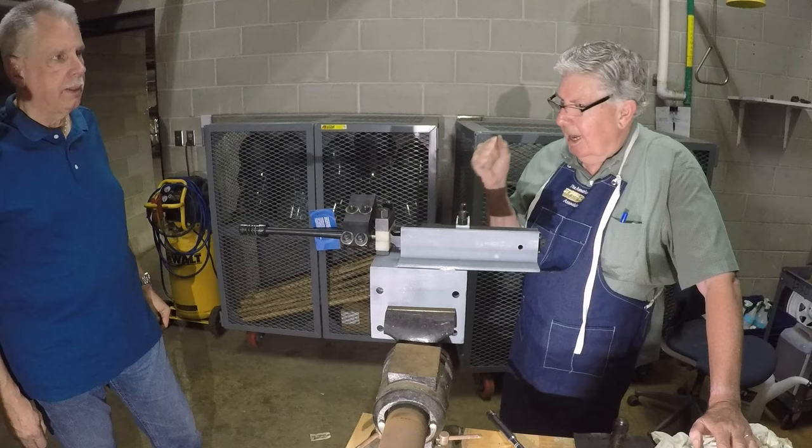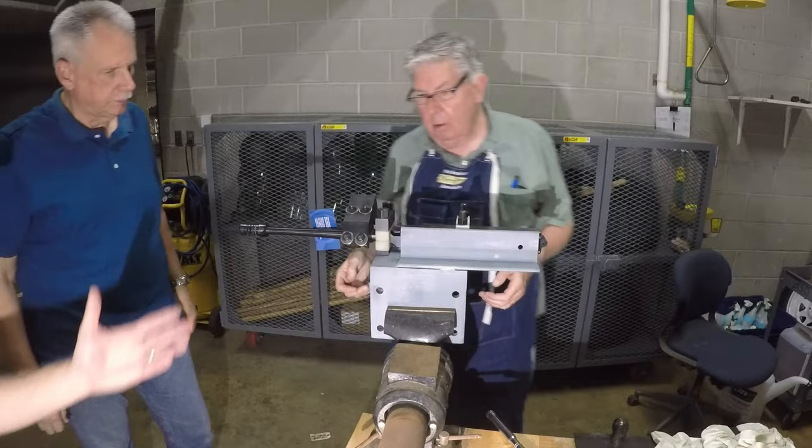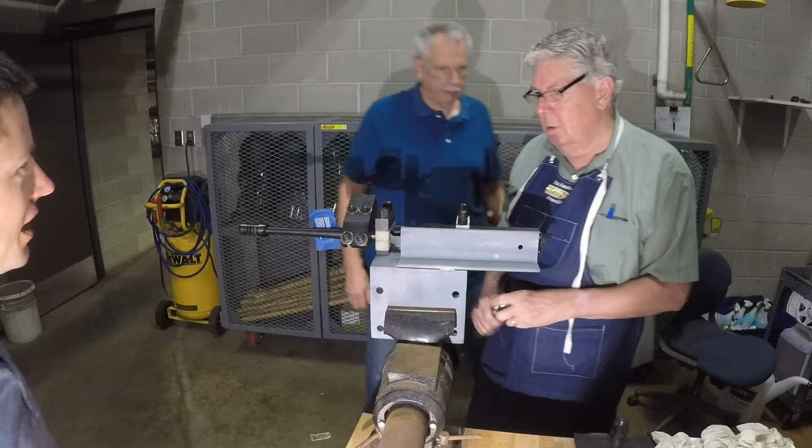It ain't cranked down. Nobody really did this to it. It's not really cranked down, but it's tight enough, the headspace is right so that it fires the cartridge, which is all you want, and you're going to replace it anyway. And nobody filled it with Loctite either, so that tells me the repair was probably well before the era of Loctite, right? Because they probably would have used it.